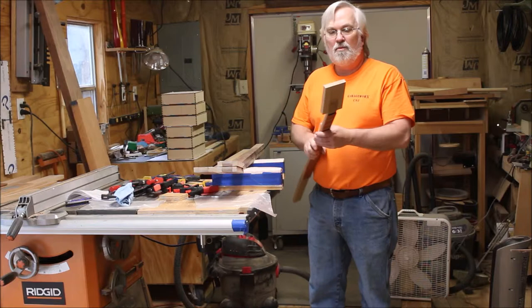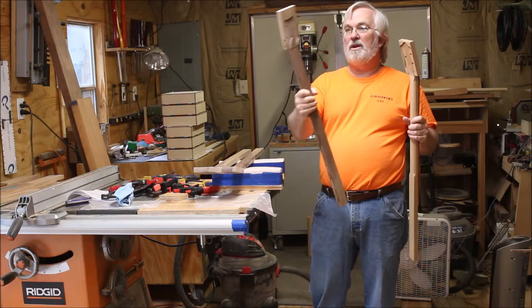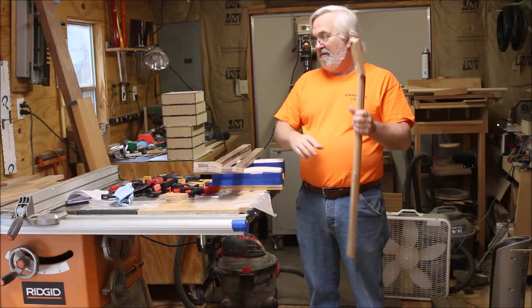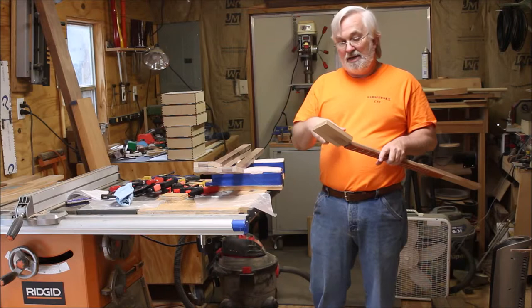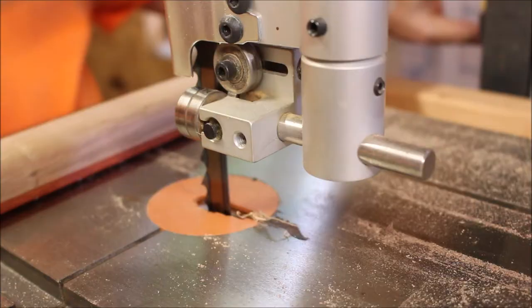I'm back here in my shop — all the CNC work is done. You can see we've got the basic shape cut most of the way and the holes for the tuners already in. I actually ran four of them. I was going to show how I do one of these without the fretboard on it, but it's really pretty much the same thing. The only difference is I don't use that spacer, which makes it a little easier. Once I get the headstock cut out, I'll glue the fretboard on those and fret them. The only thing left to do is cut these off with the bandsaw — you could use a scroll saw, jigsaw, or a lot of different ways. I'm just showing you how I do it because I was asked to.